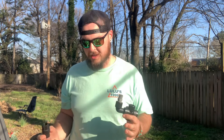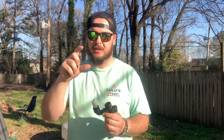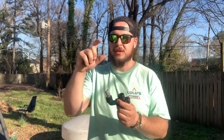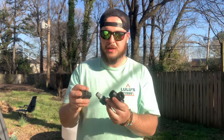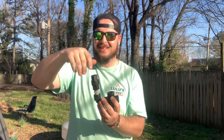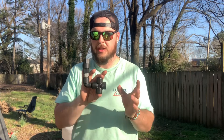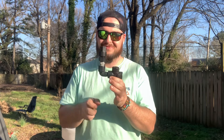From my understanding, you can do these either way. I'm putting my check valve here because I want my metering valves up a little bit higher for where they're positioned. But you can either put the metering valves first and then your check valves, or your check valves and then your metering valves. These are banjo metering valves, and there's a little arrow — we want it pressing down because this is our inlet side. Our metering valves are going to sit up here. Chemicals are going to come down here and then out to our gun. We don't want them going back up into the tanks. We want them to stay right in this four-way manifold. So we've got our half-inch check valves, half-inch coupler, half-inch elbow.